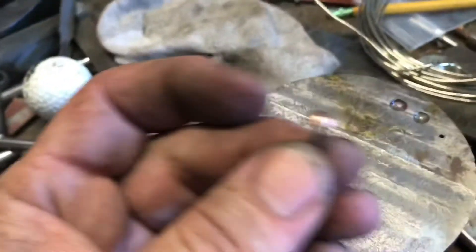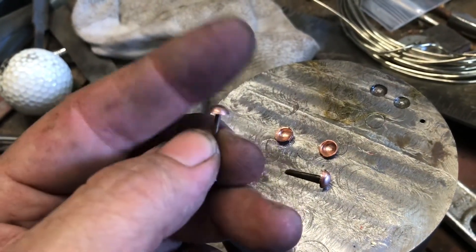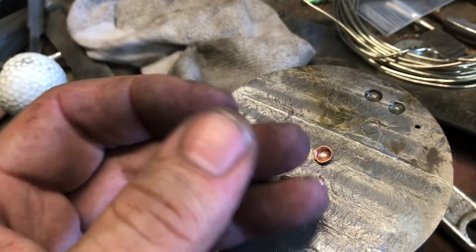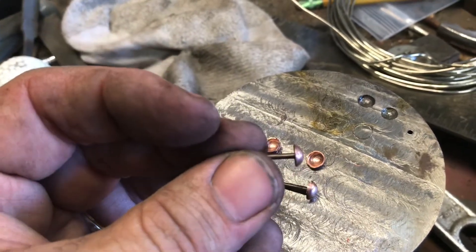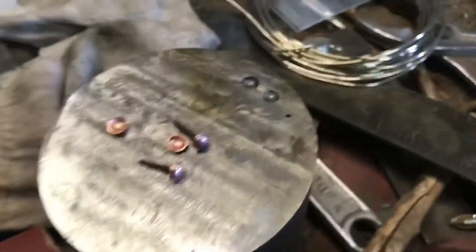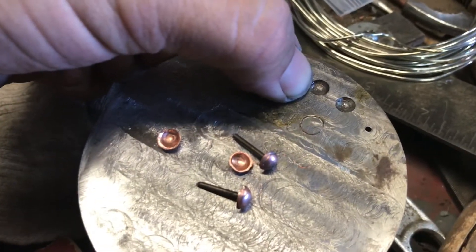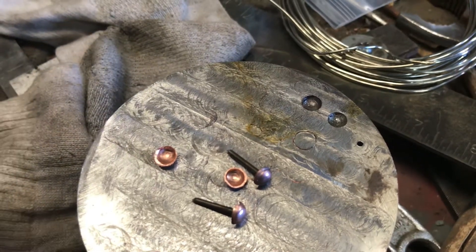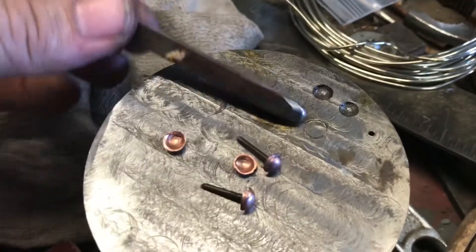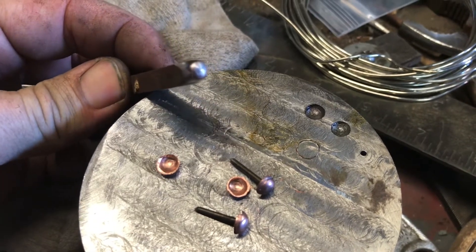The basic idea — you can see that — is a little pin head that's rounded on top of a piece of pin stock. How do you do that? Well, here are the tools. First, they have a quarter-inch hole. I cut that with a round end mill, and then I have a quarter-inch punch that I rounded off also to match.